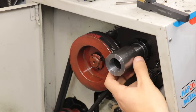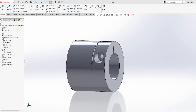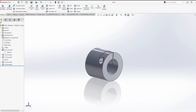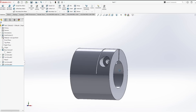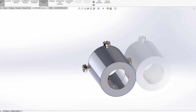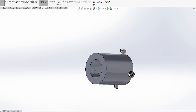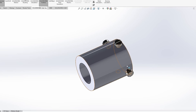With the sleeve now made and fitting on the back of the spindle, I now need to figure out how to clamp it in place. The original plan was to use a cap head screw to pull a slot closed and clamp it onto the spindle. It's not my idea and I'm sure it would have worked well, but unfortunately the stock wasn't large enough and I didn't have time to go out and get a larger piece of steel. Plan B was to use a couple of set screws to hold it in place, but I didn't want to mark up the outside of the spindle with grub screws, and whilst I might have used softer brass bolts, I don't carry much brass these days.